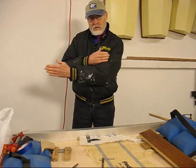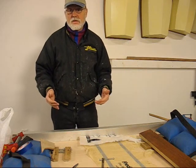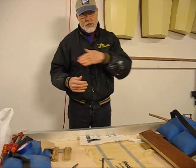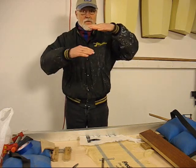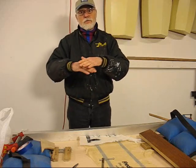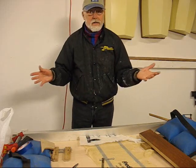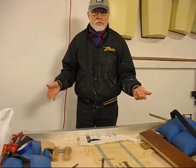On this design it will be important that it is square, because there will be no lofting offsets from the top edge to give you a sheer curve — it'll be a straight line. I changed it from the original plans that had the centers lower than the ends, so both the top and bottom had a curve to them, but now they will be using straight edges to make the boat simpler. When I made the model, it looked just as good with straight edges as it did with the difficult-to-loft curves.